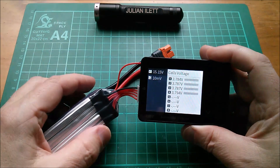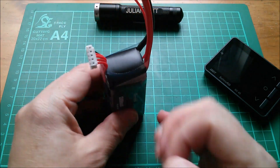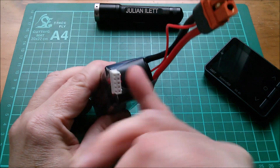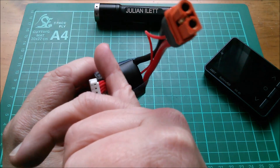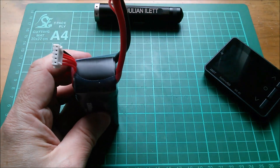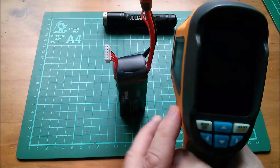So it may have a 10 millivolt discrepancy between the cells when it's finally completed the job. Now, the other thing I've noticed — let's just unplug that. As I say, that shouldn't interfere with this battery's process of bringing the cell voltages down. But the other thing I've noticed is that there's a warm patch on this black covering here, up at this end next to the balanced charge cable. It just feels a bit warmer there. I thought, well, that's not very convincing. So I've gone and got the Zintest thermal imaging camera, and I want to see if I can show this warm patch.